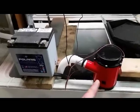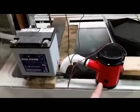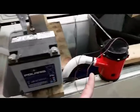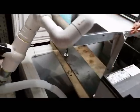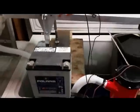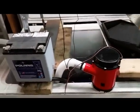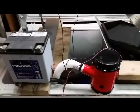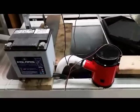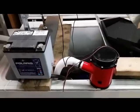This is a shot of the pump I was using for demonstration. I picked this up off of Black Cat Mining's website and you can pick them up off several other prospecting websites. That site had two different sizes — this is the larger of the two and it's a little bit of overkill for your system. As you see the shutoff valve is almost three quarters of the way off, but that obviously doesn't hurt the pump. If you want to shut them down that severely it does not matter — it doesn't do any damage. You could also use a smaller pump or you may even be able to hook up a garden hose to the system. A plug-in pump would work just fine, like the kind you'd see at Home Depot for fountains or those little pool pumps.